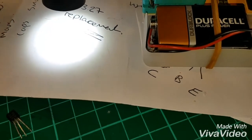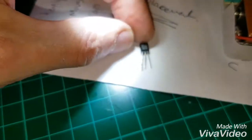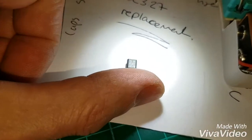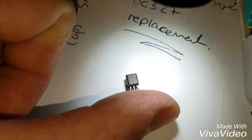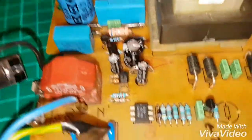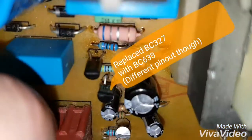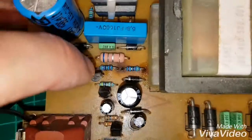The second thing that had failed was this transistor. It's a BC327, a pretty common PNP transistor. I had a little rummage round and I put in a BC638 — I've had to twist the legs differently because the pinout is different. So I replaced that.